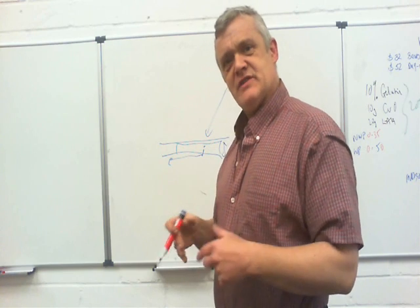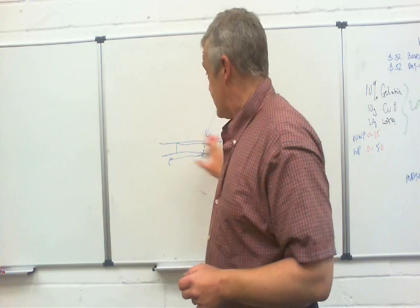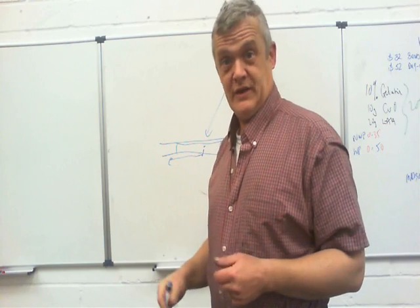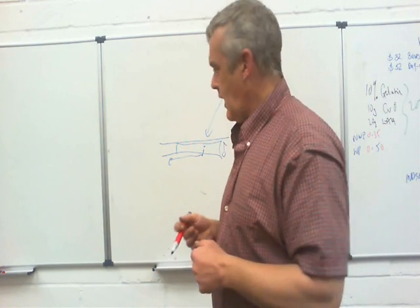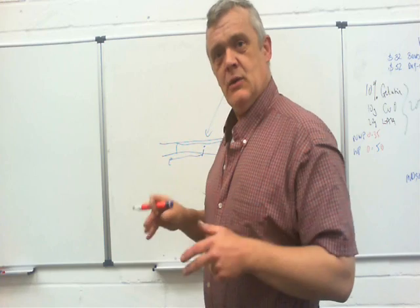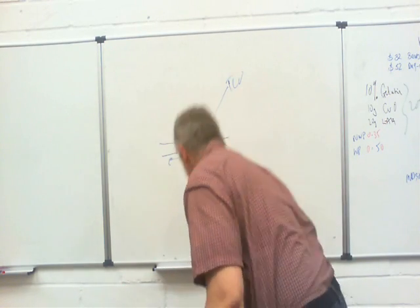That means you get these large flat panels with a big current collector behind and a transparent conductive oxide on front. They're usually very rigid — this TCO, which is usually tin oxide incidentally, is very expensive — and they're quite fragile. And it made me think: okay, well, can we rethink this? Because if we don't have to have these big flat panels, we can put it onto any substrate and make it flexible. So the rethink went along these lines.